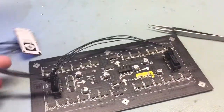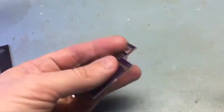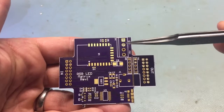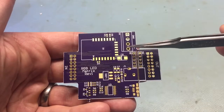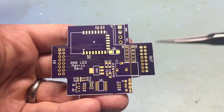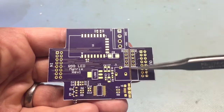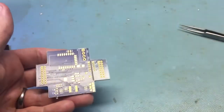I decided to create a custom board for it. It looks like this. You have the two connectors on the bottom, the in and the out, and the ESP8266. The barrel jack is here and it's also connected to this, and this runs down to your display. This is your USB chip for uploading sketches to it, and it has a breakaway part here so it snaps off into two separate boards.